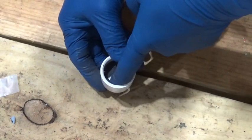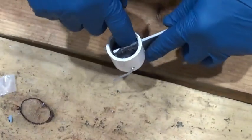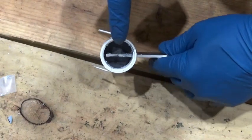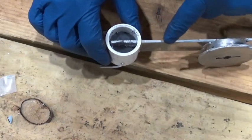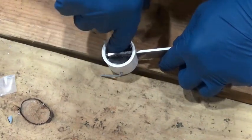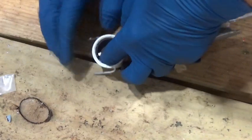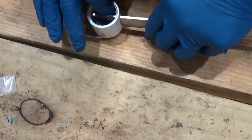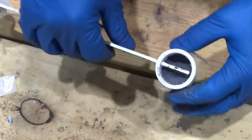I didn't take a whole lot because I'm just going to take about half of it and put half on this side. The reason I'm using this instead of caulk is because I've got aluminum on this side and an aluminum rod through the middle. I'm going to push it down in there but I don't want to completely fill this up with JB Weld — I don't need the extra weight on my propeller. All I want to do is hold that rod in so it does not come out.